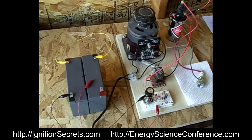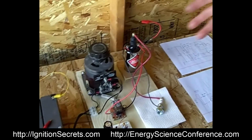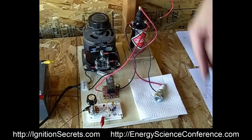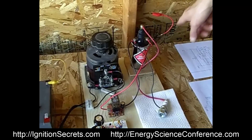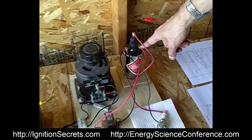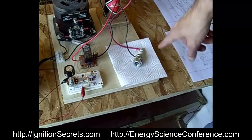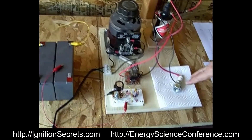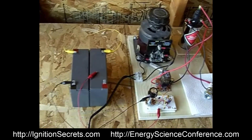First of all, I'm going to run this thing in three modes. One, standard mode where we're just discharging the cap into the coil and running the spark. The second mode will be to include the diode in the circuit between the low voltage plus and the high voltage plus and see the difference in the spark. And then the third aspect is we'll spray a little bit of water into the spark and show you the difference there.